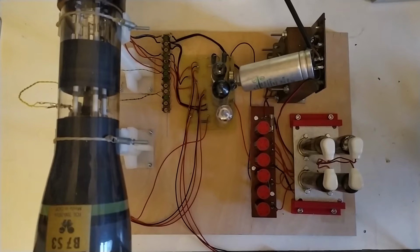It was also suggested to me by someone who has a lot more experience working with all sorts of picture tubes that it might be due to the DC voltages going into the tube not being properly decoupled. So I put decoupling caps on most of the pins on the socket and also on the anode voltage and acceleration grid pins, which should basically stop noise from getting in there. This was successful to some extent. It reduced noise a little bit, but it's still very much noticeable.